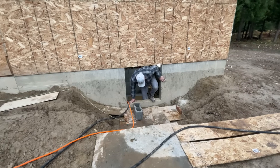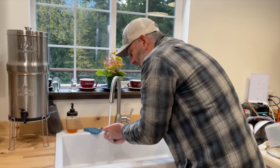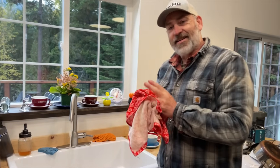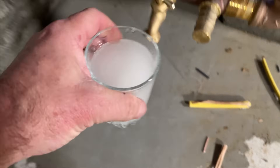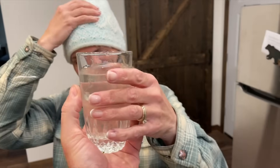No leaks. Water stopped running, which means the valves are closed up there. Now we open this last valve and it will let water go up to the apartment. We go up and turn on the kitchen sink — it spits and sputters a bit as air comes through and agitates the stuff on the inside of the water pipe walls. Once all the air is out of the lines, we've got nice clean water up in the apartment. I'm going to get a glass from down here — before the filters — for the taste test comparison.